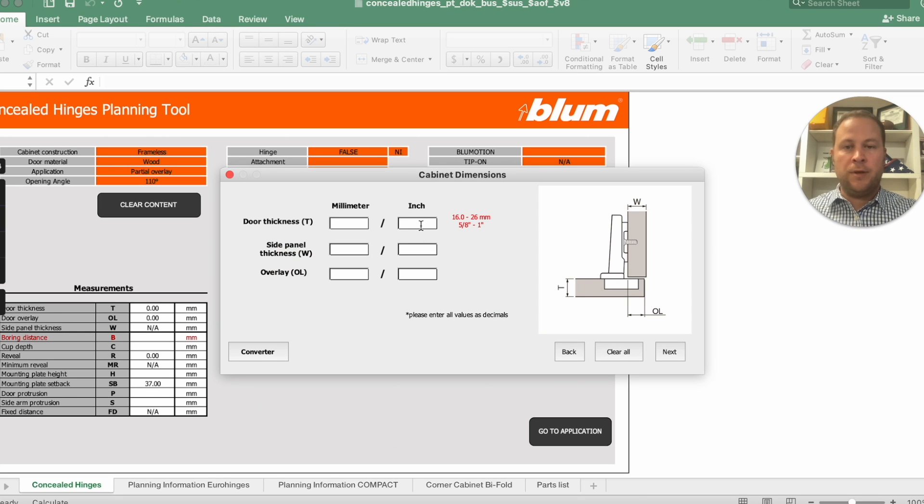Then this is important — you need to know the thickness of your materials. The frame of my doors is 1x3 poplar, but just like all other wood, it's not the exact dimension. These are actually about 0.75 by 2.5, so we'll call it 0.75. The three-quarter inch birch plywood I used is really about 0.656 rather than three-quarter. For the overlay — picture two doors, one on either side — I want a small gap between the doors so they're not touching or rubbing. I'm going to divide 0.6 by three, so 0.2 for each side.